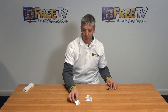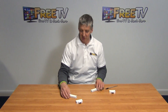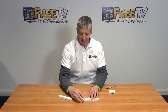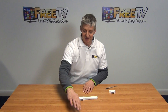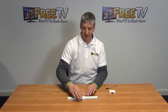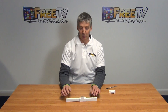So what I'm going to do here is just a quick demonstration. I have two pre-cut lengths of 25mm wide by 16mm trunking, and if we come along — imagine one piece running in like this, another length running in this direction, running them back as a single trunking up here — then clip in the third piece of trunking, and if you see it from the front end you can see what a neat job it makes in terms of the finish, both securing it and giving a very neat finish.